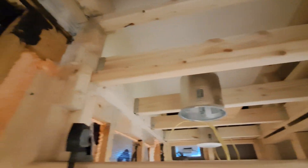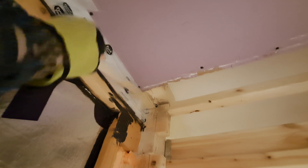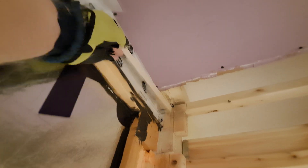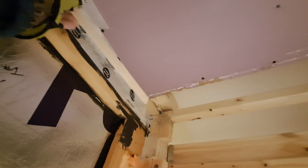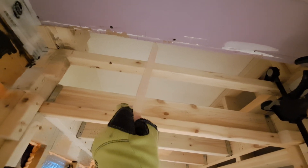I've been letting this sit for a couple of days, so it's ready to go. What I did here was mimic the level of the sheetrock — because there's no sheetrock here, this needed to go all the way to the corner to give me a nice level installation for that shiplap. I had to do the same thing over here. I need to come up with something to span from here over to this corner, just to give me a little backer for the shiplap — not that the shiplap needs it, but the crown will need something to nail to.